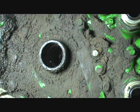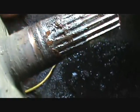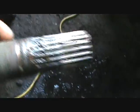There's a lot of neat things in there and I didn't get a chance to look, but here, Tim, hold this light. I didn't get a chance to look too close last night. What are you turning it off for? This is the input shaft. That will strip out. Go ahead, put it so I can see to the back. You can see that they're getting very thin. I've put grease inside of those because I actually replaced this already once. But you see that worn spot there? It's out of balance. It's wobbling in there because of those splines.